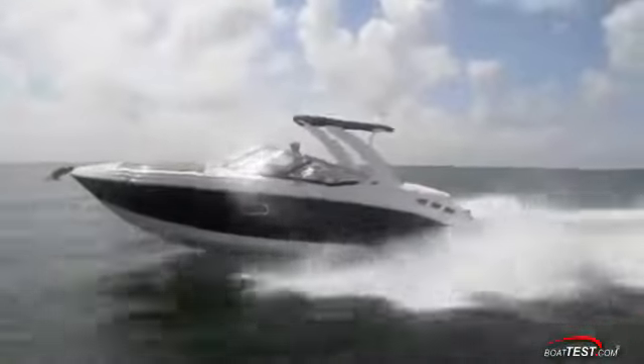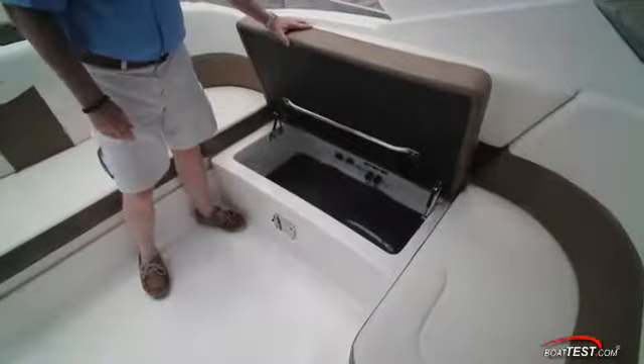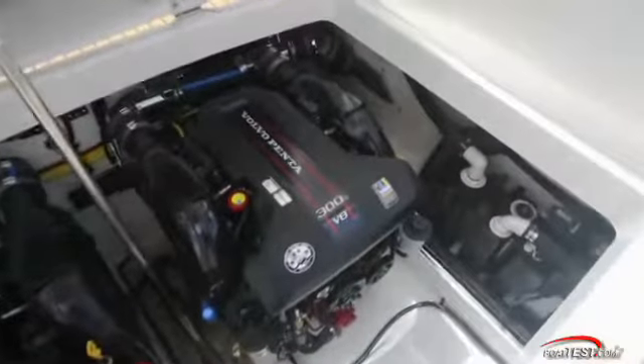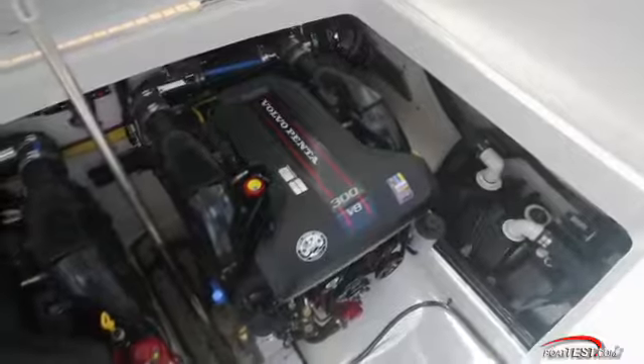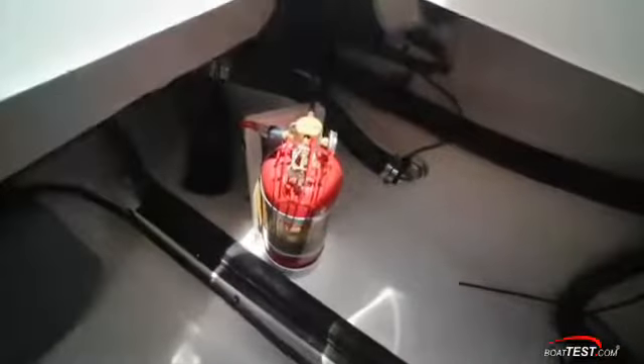Let's start with a look at the operational details. When coming aboard, the battery switches under the seat need to be turned on. The battery is located under the opposite seat with a drain keeping water away. A switch at the helm brings up the electrically actuated engine hatch for the daily checks. Our test boat was fitted with a pair of Volvo Penta V8 300s, but options include single engines between 380 and 430 horsepower, or twins between 220 and 300 horsepower. Chaparral created a roomy installation in this compartment with a work platform at the forward bulkhead. The automatic discharge fire extinguisher is standard.